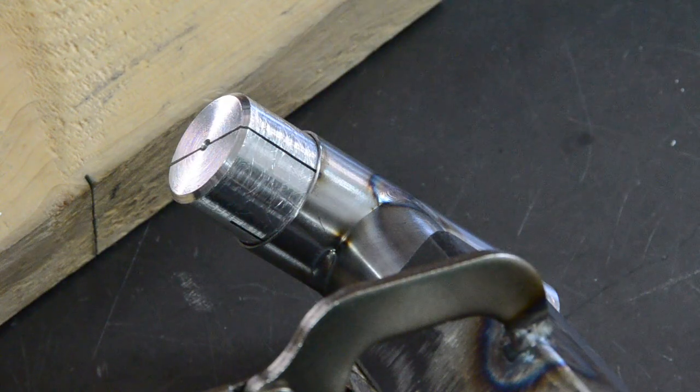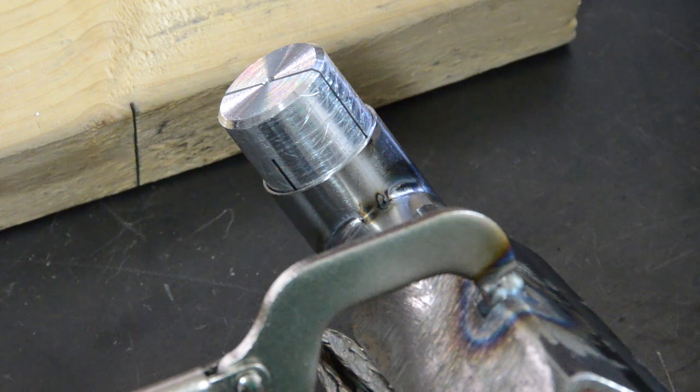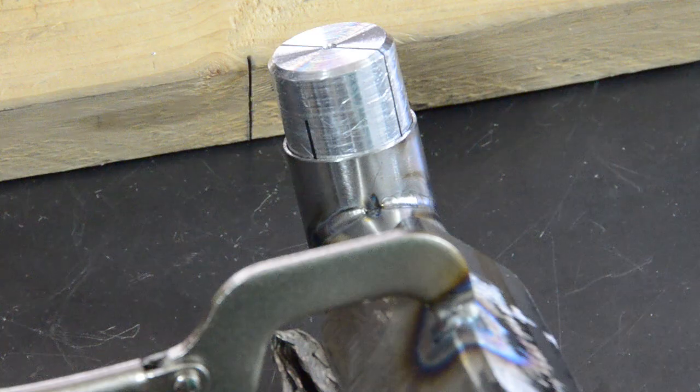Now I'm doing the other side left-handed, because I haven't done this in a while and thought it'd be good practice — and it was pretty much a disaster. You can see I balled it up and managed to get no filler into the gap. I'm going to start that off again right in the same place. The reason this happened is you can see I've got way too much torch angle.